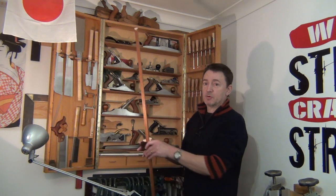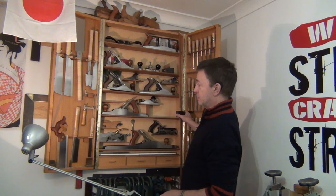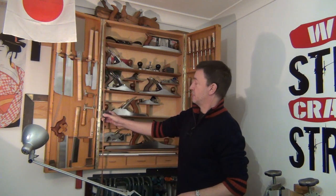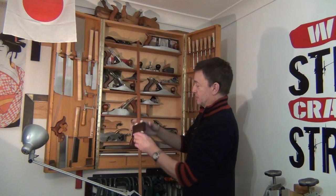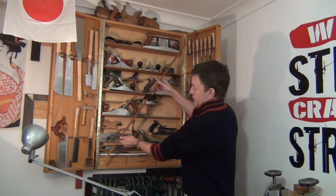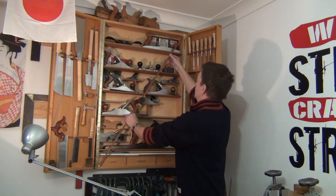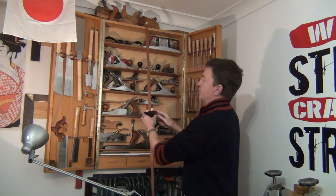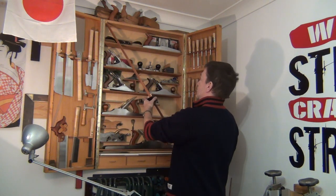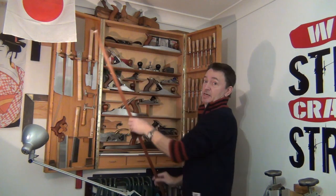But I can also check them with the pinch sticks in place, so I can check the length of that vertical and of that vertical, check they're the same, check the top and bottom are the same, and then where the real wizardry comes in, and it's just this basic geometry, we extend the pinch sticks between the opposite corners for the diagonal, lock them off, and then check that the opposite diagonal is exactly the same measurement. And if it is, then you know that the thing's square.